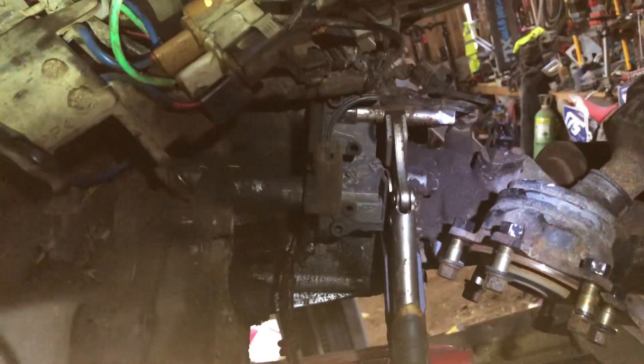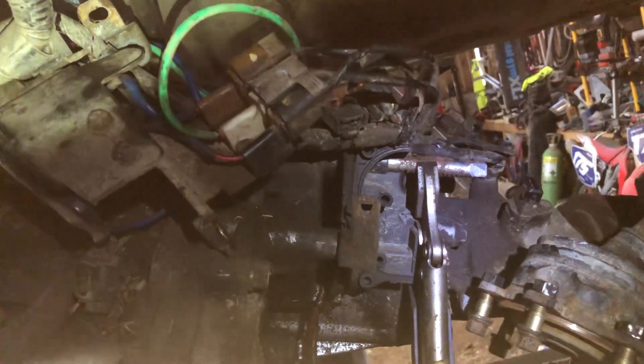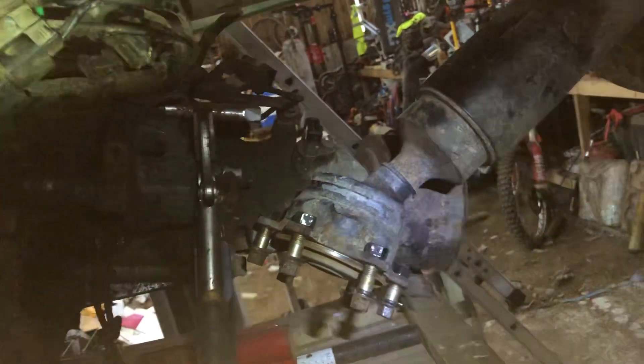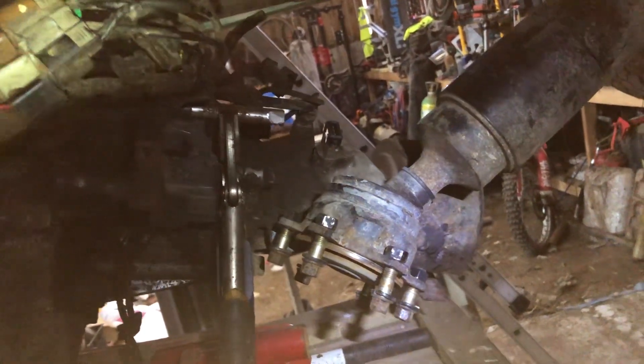The diff lock is on the front of this axle, with air pressure off the turbo that goes in on an electric. So that should still work on the electric bit inside the cab, but we don't know yet. So this is what I'm on at the moment — I'm drilling a hole through there so we'll be able to get some kind of lever in position that goes up through the floor, because I can't use four-wheel drive at the moment.